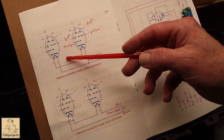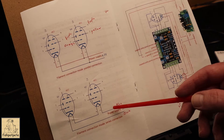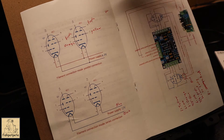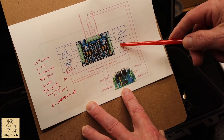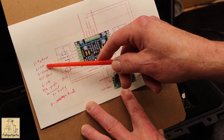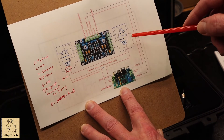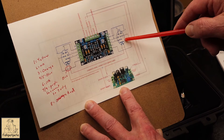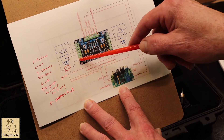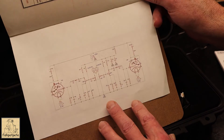They give you the pin connectors for each socket. You can connect two ways — 6.3 volt or 12 volt — and that's the power that goes to your heater, depending on your power supply. The directions have plenty of information on what goes to what. It gets a little confusing, especially if you're trimming wires, so I made sure to note that pin one is yellow, pin two is not connected, pin three is orange, and so on for each side. The wire colors on your sockets may not be consistent with the directions, so I'd advise going through and identifying each wire. The website gives a bit more information and even provides a schematic of the actual circuitry.